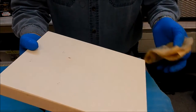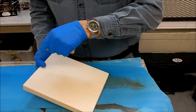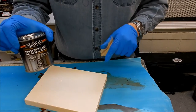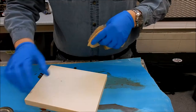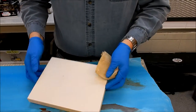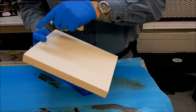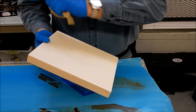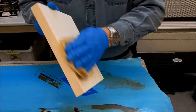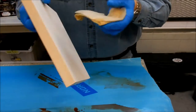This is all sanded. Don't sand where you're going to do your finishing - the stain is not that big a deal, but the top coat will show every little fleck of dust. So make sure you do the finishing away from where you're sanding. If you have a spray booth, even better to do it there to keep dust down. When you're done sanding, it's very important to get all the dust off. Use a tack rag - do not use a damp towel. If you get the wood wet it raises the grain and just wrecks everything you already did; the wood will dry and be all lumpy and bumpy again.